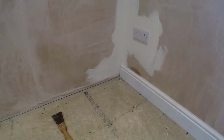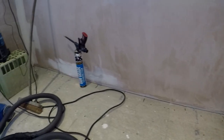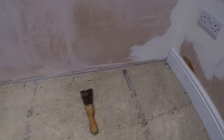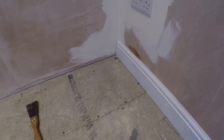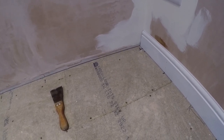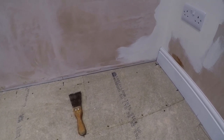I've got to get the length from there to there. The big mistake you sometimes make in your early days: you've measured it and you forget you've got to put a scribe on the end, so you've got to make the piece of skirt longer for a start, and then cut it back - which I'll now show you.